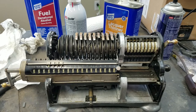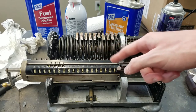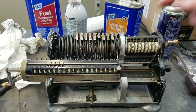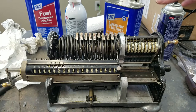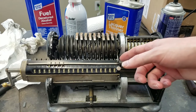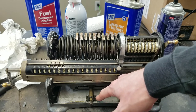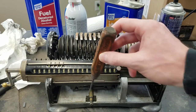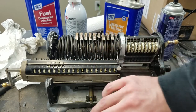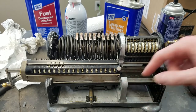So the next thing I'm going to do is I have to adjust the bell ring a little bit. Since that was bent — when I bent it back so it would fit — now it's not ringing the bell on overflow. So I have to bend that a little bit to make it actually ring the bell on overflow. I think then we should be good to put the covers back on — at least this top cover. Then we can slide the carriage because the top cover will hold this piece up out of the way. There is one screw that seems to be missing for this piece. I've got one in, got one in here, but we're missing one for here.